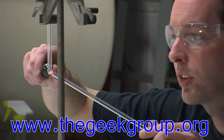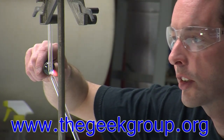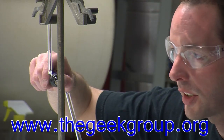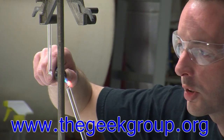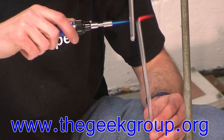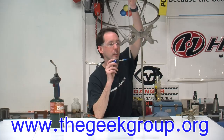You gotta be careful when you do this because it's very easy to pull out, like watch here, I'll do it. You can pull out a little hair thin strand. See, I've got that little tiny piece of glass. And these are like needles. They're really sharp and you get a sliver with that and it breaks off and now you got all kinds of problems. So I'm just gonna set that aside over there and we'll slide down some more tube.